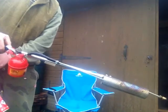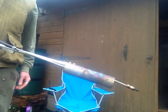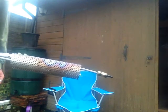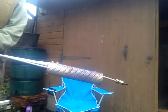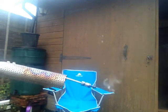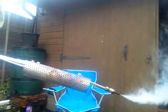As I said before you've got to be careful with these and don't set it on fire. You know when it's hot enough because the smoke will actually start coming out by itself. Don't know if you can see that guys — it's just starting to smoke now. Let it keep going, let it heat up. Don't feed any oil to it or else you'll set it on fire. There you go, it's starting to smoke on its own. When it starts heating up like this, then you can start feeding it a tiny bit of oil.